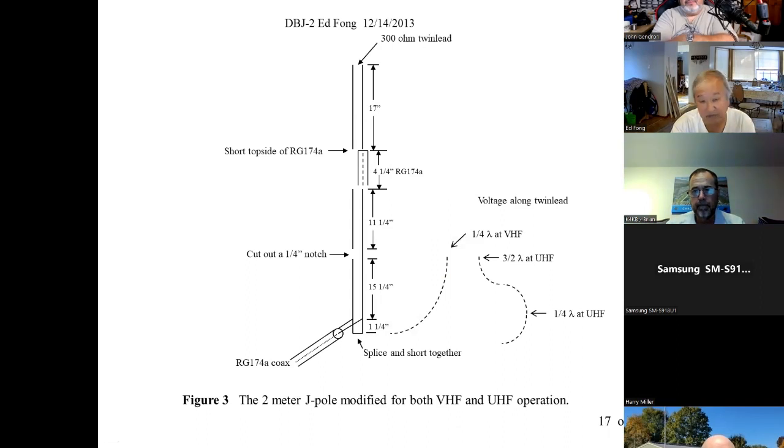So back to what we did. So you have this decoupling stub. At UHF, the matching wasn't the problem. It goes up, it sees 11 to 12 inches, boom, half wave, and it sees a high impedance point. Probably not infinity, but not bad. When we simulate it, it looks great. When we actually measure it, and people have bought this and go, yeah, it's pretty good. The performance is clearly much, much better than if you didn't have the stub at UHF. And at VHF, I'll show you the results here.